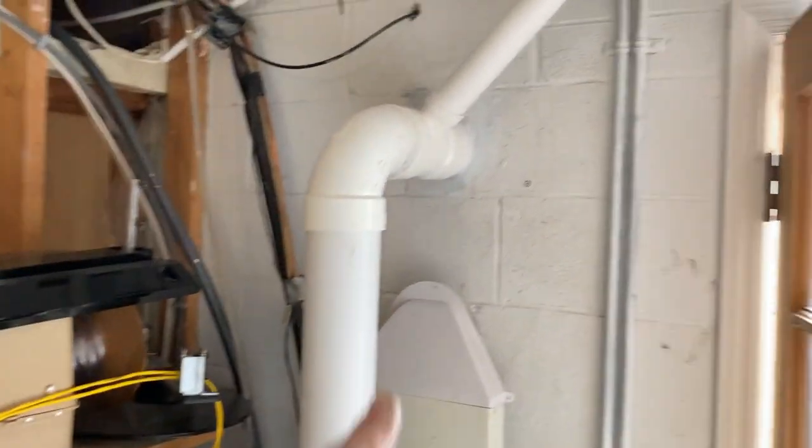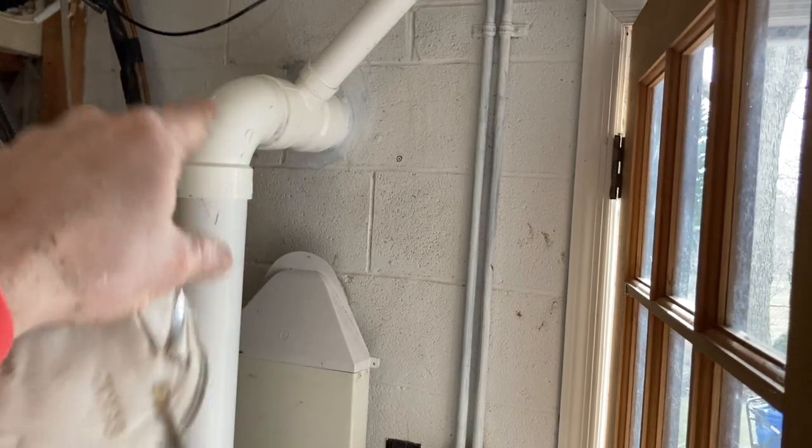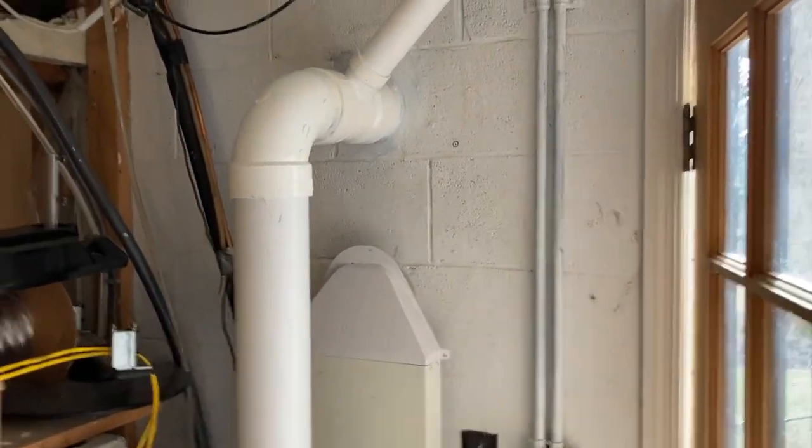And lots of times when the customer says, yeah, I've already got an existing hole for you, that's usually more trouble than it is just to make a new hole on our own. But I didn't bellyache about it to the customer. At any rate, we made it work. We just used mortar and sealed it in with expanding foam, and I think it came out looking pretty good.